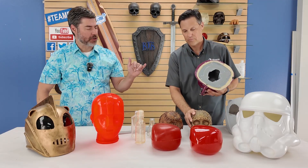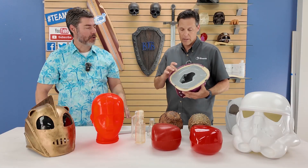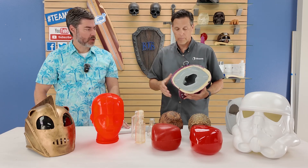You mentioned that's a TC 5130F — the fast version — that's like a 25 Shore A? Correct, 25 Shore A. We add a little bit of pigment so we can see our layers building up. For the brush-over mold, we add Thixotrope and brush it up like a normal brush-up mold, put some keys in, and then do a two-part split rigid shell. BR 75D is on either side. You could do something very similar in fiberglass, which would be a little lighter, but for a mold this size on a machine, the weight is more manageable — I'm not hand-rolling this around.